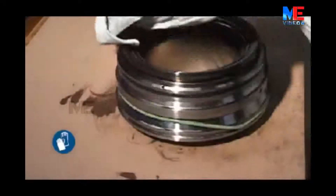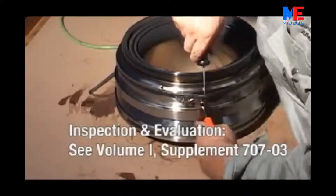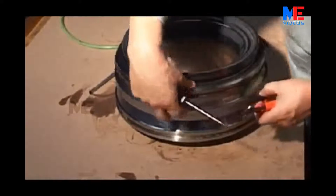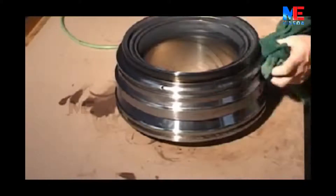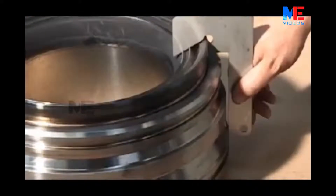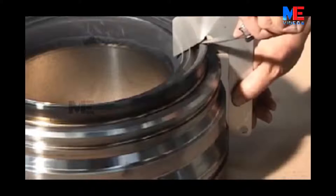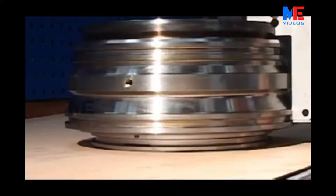Inspect and evaluate the bottom piece. Remove and destroy the O-rings, then thoroughly clean the bottom piece. Use the templates from the tool panel as well as the feeler gauge blade to check for bottom piece wear. See tolerances in datasheet 108.2. If the bottom piece is worn more than allowed in the datasheet, it must be replaced.